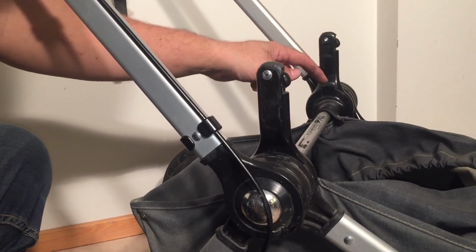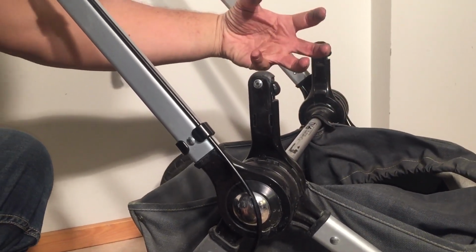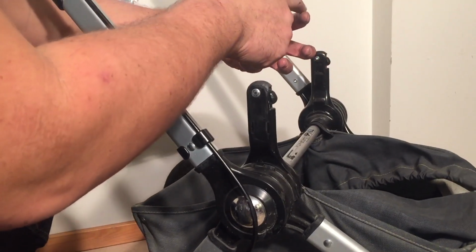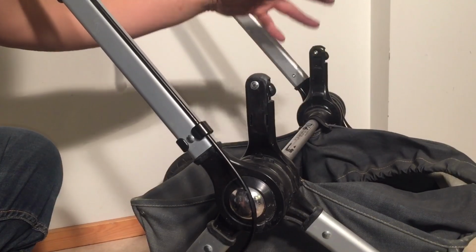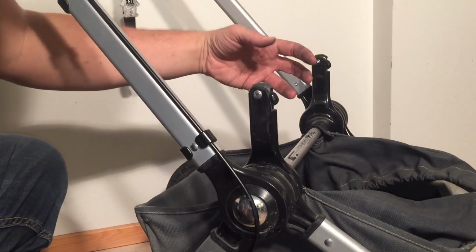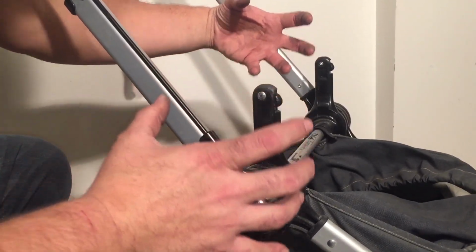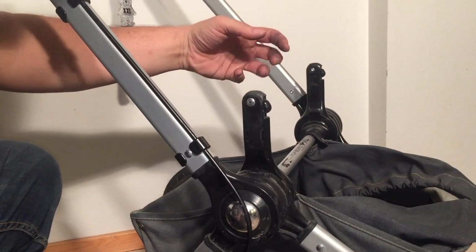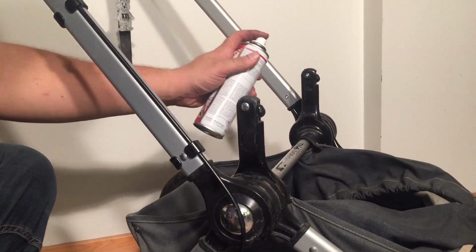Inside the disc, between, say, the two discs, is a wheel with a lot of little pegs. When that thing pushes down, when it locks in place, those pegs push out against the next disc, and the next disc has corresponding holes, and thus it grips it at very many points. So it is a pretty complex mechanism, and it should stay lubricated.